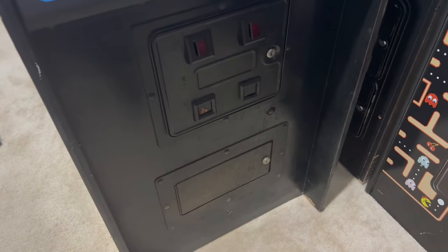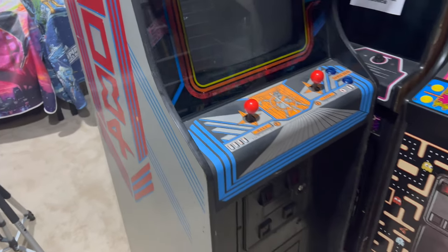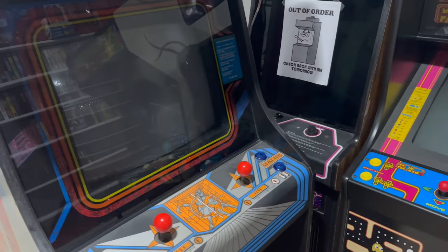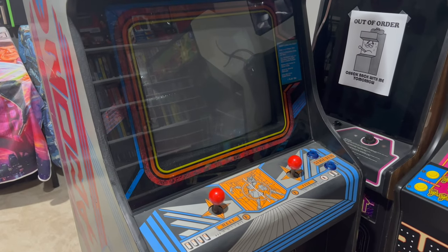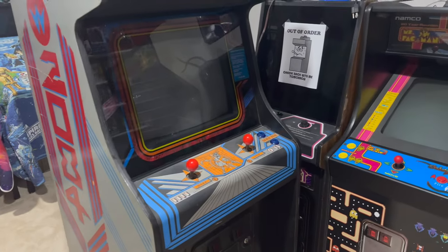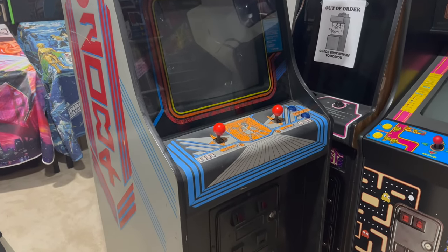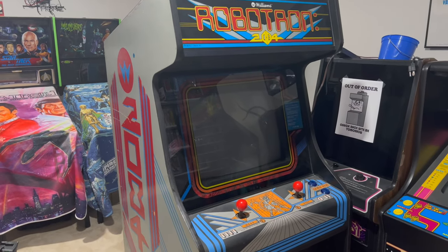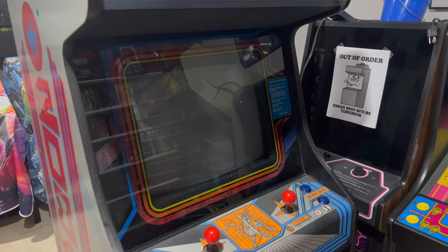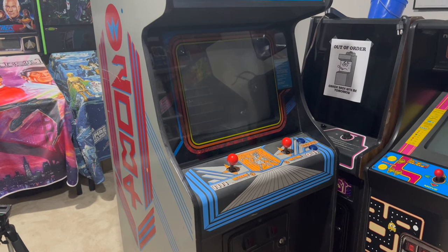We've got some rust on the coin doors here that I should definitely address at some point. The real issue I'm having is with the sound. The sound only works properly one out of ten times when I turn the machine on. The other 90% of the time, I just sort of get the game over sound repeating over and over again during attract mode and during gameplay — it just keeps repeating. When I got the game, there was quite a bit of electronic work I had to do. The game didn't work at all — no sign of life whatsoever. I ended up replacing all the header pins, recapping the monitor, sound board, and power board, replacing a bunch of different connectors, and did eventually get the game working. It does work — I've just got this sound issue.